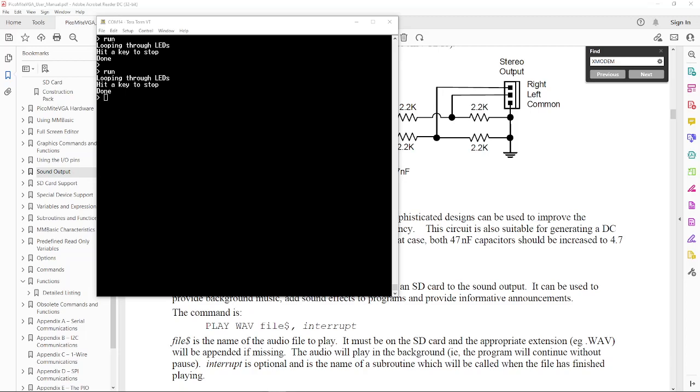One of the things that really surprised me is how easy it was to do the I2C on here, because I fumbled around with I2C on Raspberry Pis, and that's a lot of work. On Arduinos, not quite as bad, but it can be fumbly, especially talking to a more complex part like the port expander. You have to try to figure out how to do it. Those parts act more like memory. You have to give them an address, not just the I2C address, but a register address inside, and then either do a read or write. And if you're doing a read, you have to terminate the write of the address and do a read without stopping the transfer. So a little bit of tricky stuff going on there.